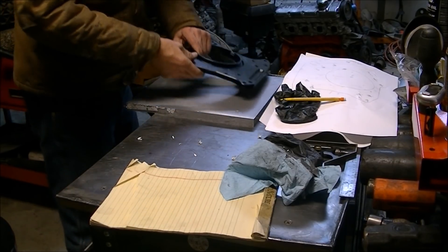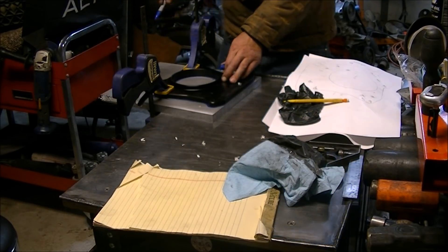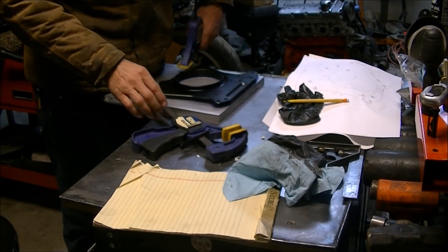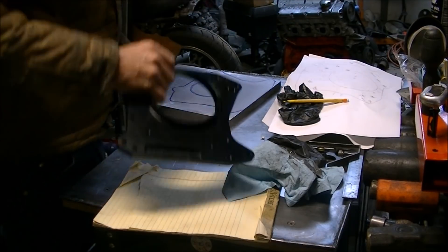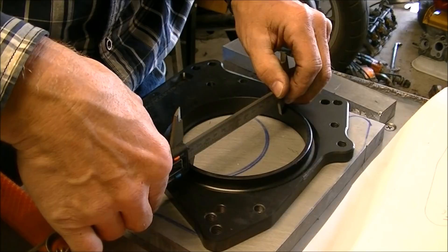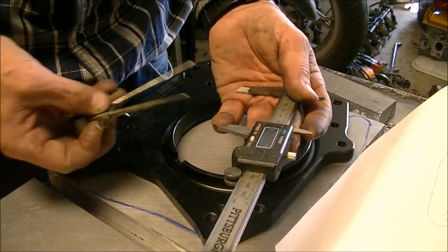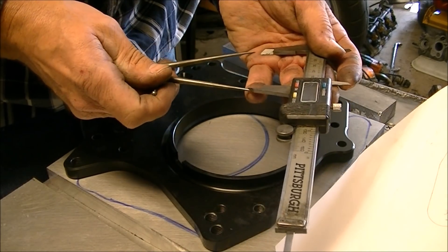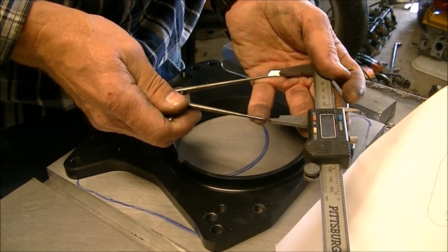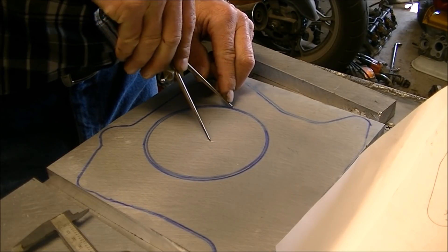Fortunately my son had an adapter plate in a car he'd bought. I was gonna buy one from the company but they were out of stock, so I thought I can make one of my own — I used the manufactured one as a template. Transmissions and bell housings bolt together, but not all of them are made specifically to bolt to another one. The bolt pattern on the Borg Warner T5 that came out of a Ford Mustang is a lot different than the bell housing on a Volvo B230, a 2.3-liter four-cylinder turbocharged engine. I needed to bolt the bell housing to the transmission because that bell housing is what bolts up to the back of the engine.